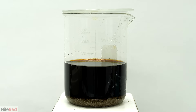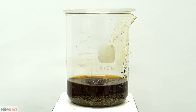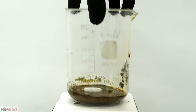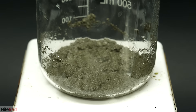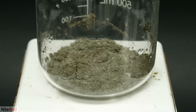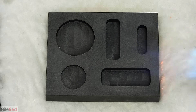When it looked like it was pretty much done, I dumped off all the liquid. Then I added some more fresh sodium hydroxide solution along with some glucose, stirred for another 10 minutes or so, and felt it was probably done. The stuff at the bottom should all be silver now but it was mixed with a bunch of base and sugar — surprisingly hard to get rid of, taking at least something like 10 washings. It did eventually look clean, so I put it back on my hot plate, cranked up the heat, and boiled off the water. I then dumped all the powder into a crucible along with some borax and started heating it with my torch.